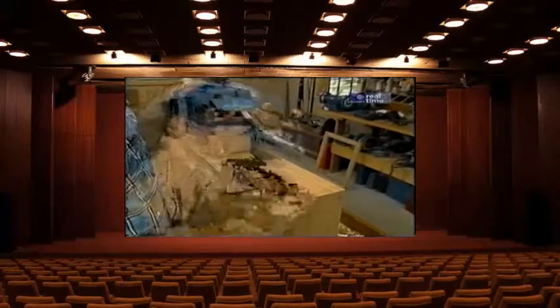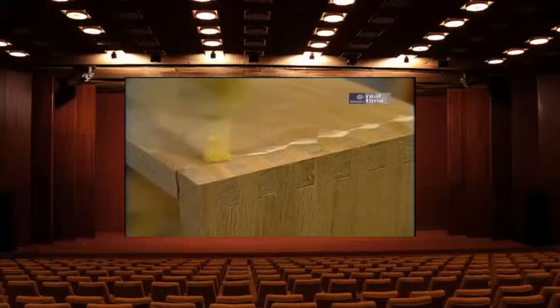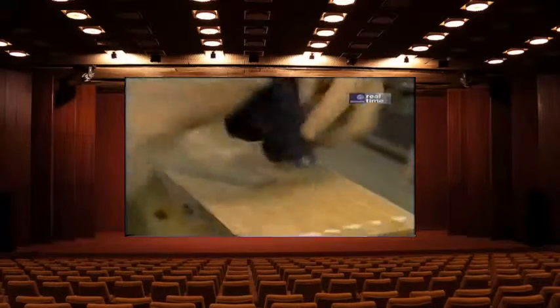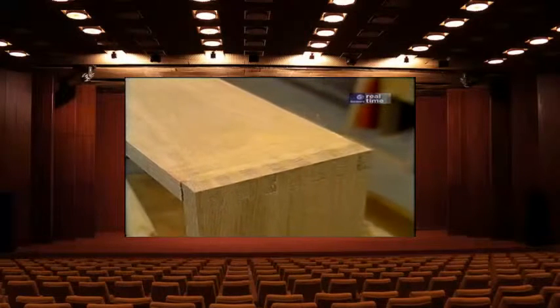With the glue set up on my case, I'm ready to sand out those box joints. But there are some little spaces — here's a little trick to fix those. Take some glue and put a little bit in each one of those cracks. Then take the bag off your sander and dump out some sawdust — the same oak. Spread that into all those little gaps. When you run the sander over it again, no one's ever going to know those spaces were there.